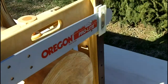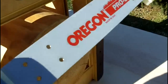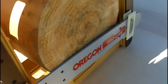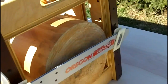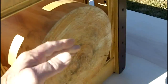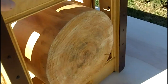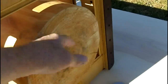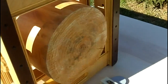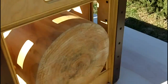The nice thing about trimming with this type of saw is that because of the belly of the bar, the round part of that bar, after you've end trimmed your workpiece, you can actually tilt your bar as you come back through it and create a dished out center portion. If you've got a round log you're using for a post, it won't have a ball joint on the end. It'll have a little recessed area, and it also makes it nice if you're butting two logs together. So that's a nice feature about having a guided device that you have some flexibility with.